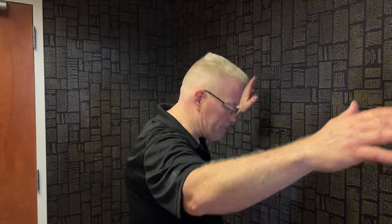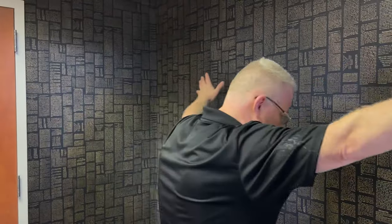That is a 48 inch wide bench upon which you stand and hang your wallpaper. Be aware that the forward edge will droop because you don't have control over it while you're joining the left side, so you have to check the right side before you make your cuts. This is vinyl. You can be off 2 inches and not have any buckles in it.